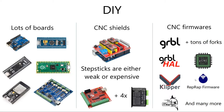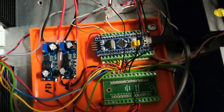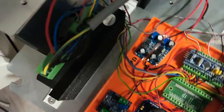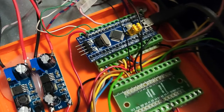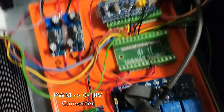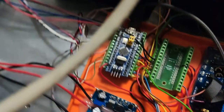There are quite a lot of breakout boards dedicated for this use case, but you don't have to use one. I don't have any, so I simply connected microcontroller pins directly to the stepper motor drivers. I could recommend a DIY setup for people who have quite a bit of electronics lying around — maybe they can use something they already have instead of purchasing new stuff. This also requires a bit of electrical knowledge and I wouldn't recommend it to beginners.